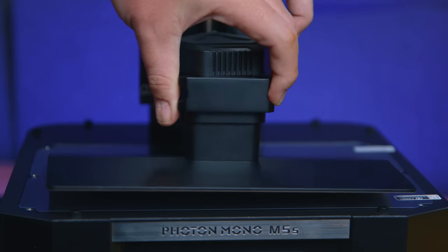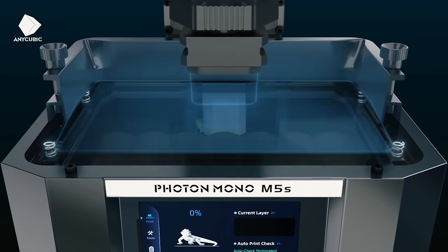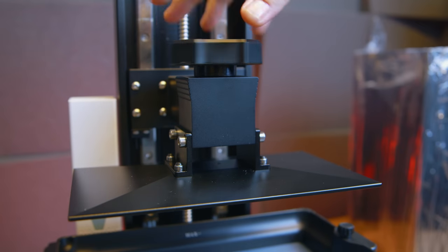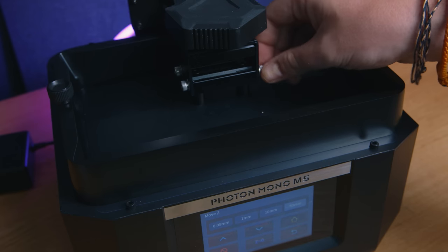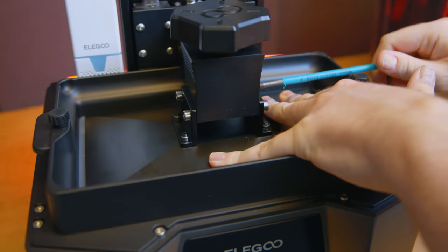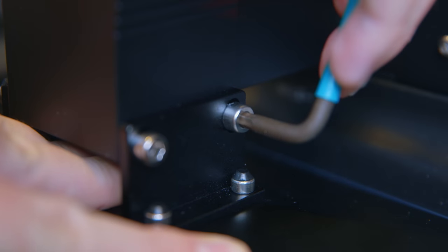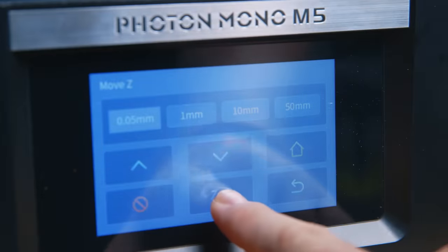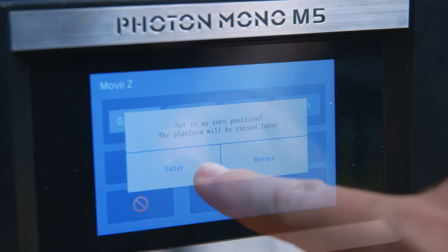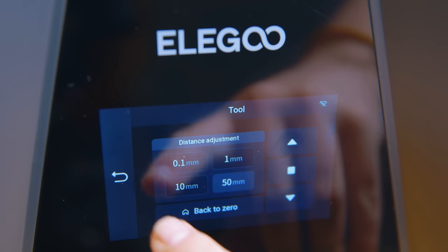When tightening any of these mechanisms, you want them as tight as possible, but I can genuinely feel that if I add any more force to the sockets on the M5, I'll thread either the screw or the socket. The M5S, however, has no levelling mechanism — it has auto levelling built in using pressure sensors under the screen. For the levelling process on either of the Elegoos or the M5, you loosen the screws, send the bed to home, then tighten the screws while holding the bed down. For the ones with four corner bolts, tighten them in alternating corners a quarter of a turn at a time.